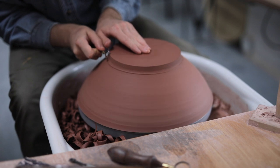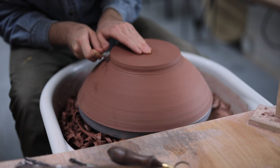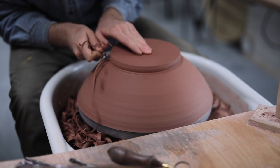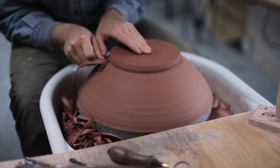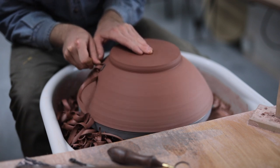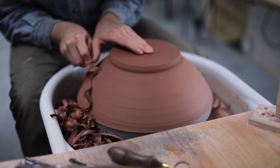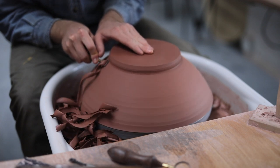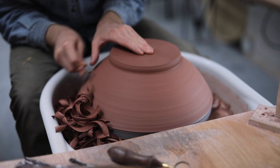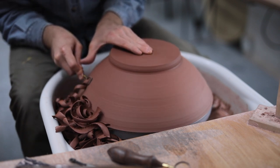It's always worth watching not only what the tool is doing, but what the hands do too. As I trim, I constantly try to keep my two hands connected in some way — here, by my thumbs — although at this point it is a totally subconscious effort. Doing this adds stability to your movements, which is vital for trimming. You want to be the one in control. If a bump or slight undulation comes along, you want to be using enough pressure and force to trim right through it, instead of letting that discrepancy influence your turning.